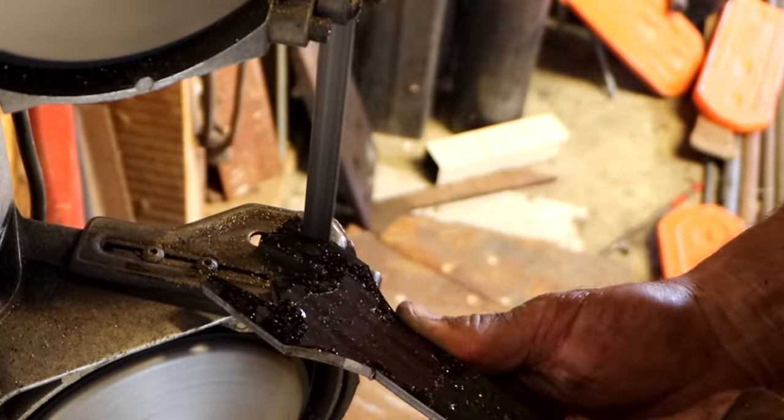Well, no water in it. Same nasty smelling black stuff. And it doesn't smell like sulfur. A lot of gear oil will smell like rotten eggs because it has sulfur from some of the friction modifiers. I don't know. I think this smells burnt. It doesn't smell good. I don't understand people that spend so much money for equipment and then don't maintain it. Yeah, there's definitely not as much oil in this side. So, do I have a leak? Where'd the oil go?